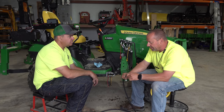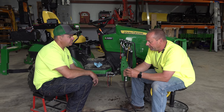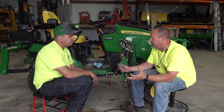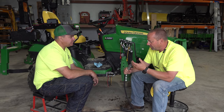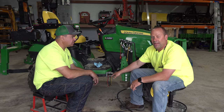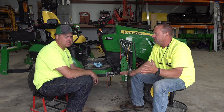We hope to be offering them on the website in the future, maybe a 5-pack or a 4-pack, since there's four. But because it's a common problem and O-rings are cheap, the only things in hydraulics that are cheap are O-rings and advice, right? Everything else is crazy expensive, right? So for a quarter-inch coupler like these, the quarter-inch ISO 5675, it's a number 113 O-ring. If you Google O-ring charts, okay.